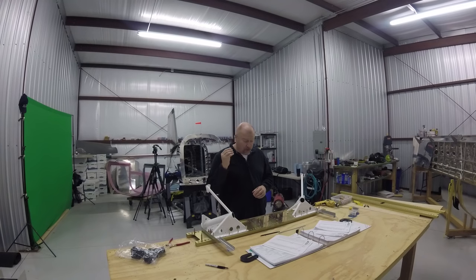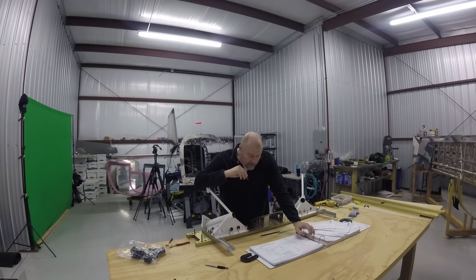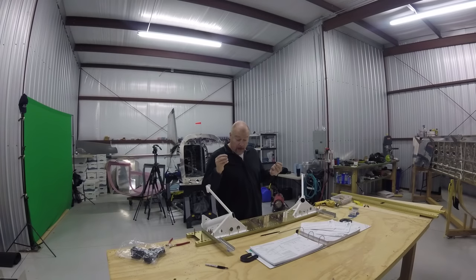So the bushings don't fit — they try to, but they don't quite fit. These are the right bushings, so I do have the right ones after all. I think I'm going to just touch the edges ever so slightly on the disc grinder using the aluminum, because I can kind of feel a little bit of an edge. Maybe when they cut these it imparted a small burr — I can't see it but I can feel it. So maybe doing that will make them fit, and then I'll get the number 30 drill and give that a shot.